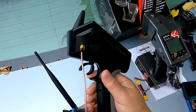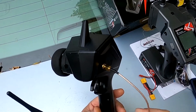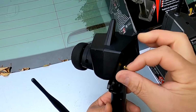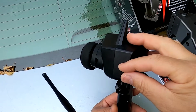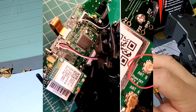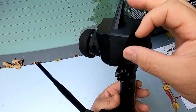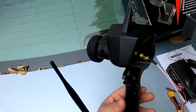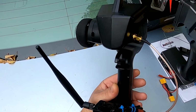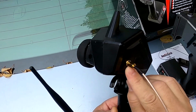Be careful of that. Just take it apart, and on the circuit board there's something that looks like this, which is your antenna. There's a tiny little UFL connector, and it just looks like a little tiny button. It's just clipped on, so you just very gently pull it off. It'll just come off, and then I'll put the links in the description for what you need, but you put the new one on. It's basically just an extension, really. It's not an actual antenna, but you clip that on, and then I drilled a hole right here.